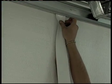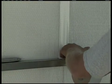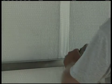On the inside of the building, use the single-sided white or scrim tape and run that over any of the seams. When you come to an exterior frame piece, use your razor knife to trim any excess that gets stuck to those frame parts. Be sure to evenly and firmly press the tape, especially against the seams, so it adheres properly.